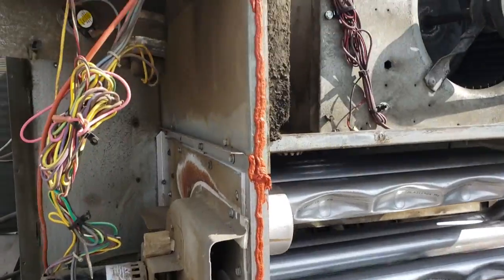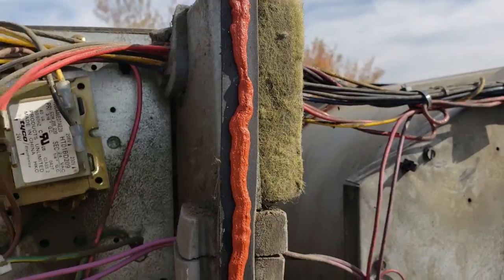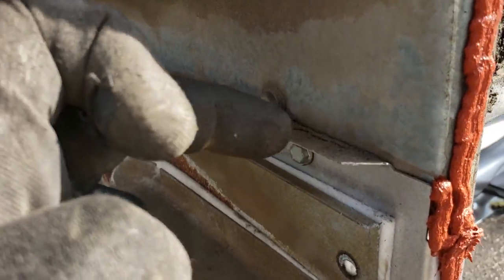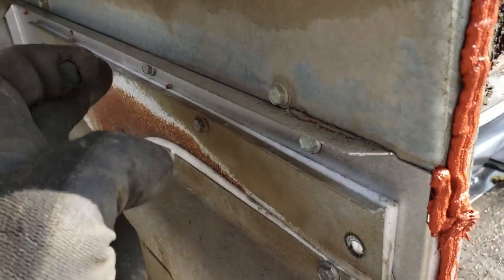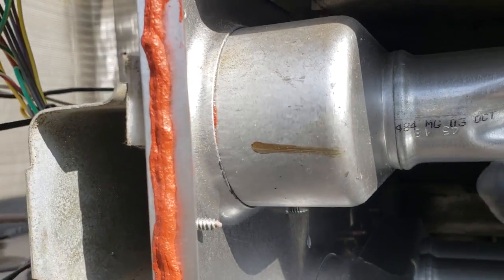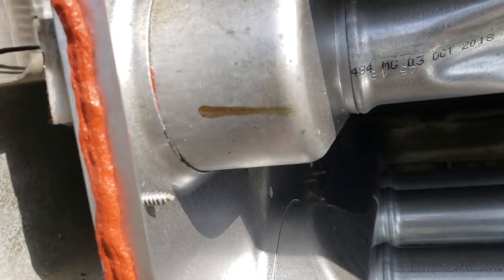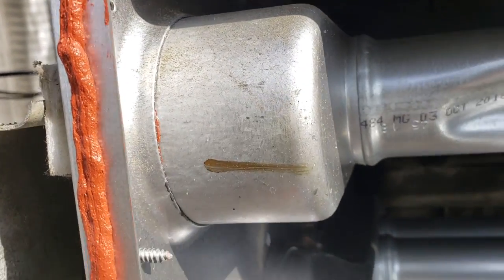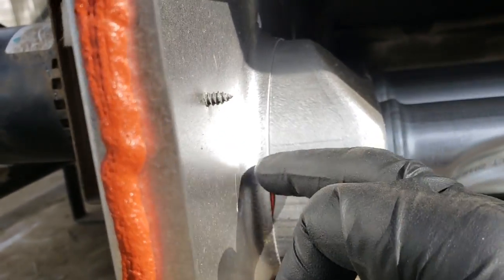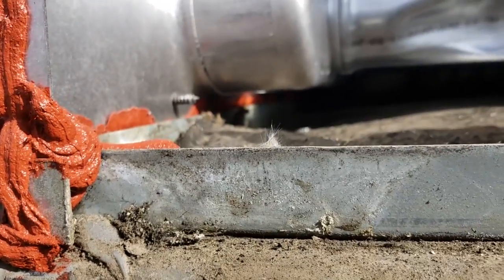We're just moving along. I did not have the black rubber material they were using to seal, so we've got some high-temperature silicone to seal this area. I also used it to seal where there was black rubber tape behind the heat exchanger surface. I used high-temp silicone back there too so we were sealed off — and that's actually what the manufacturer used as well. I made sure it's not dripping down on the heat exchanger because I don't want it to burn. You can see where it's mushing up down there.